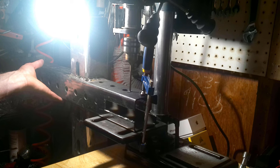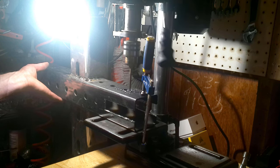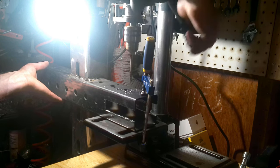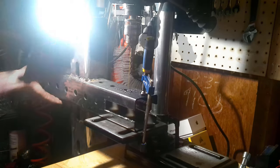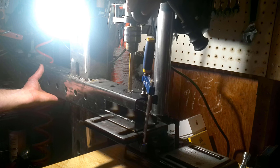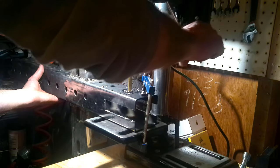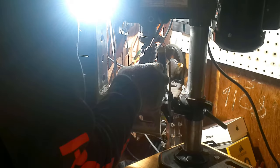Next, we're going to make our holes for the wheels to go in, our pulley wheels. And also, we're going to make our 5/8 holes for where our pop pins are going to go on the other portion of the bracket. I would recommend using 3-in-1 oil, doing a pilot hole first, and then going up to the bit you're going to use. I'll have all the details on the website or in the description on the bits that you need to use.